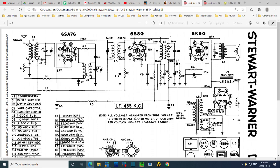So, and this is about the local oscillator. So this is having some bearing on the operation of the local oscillator. Unless the fact is, how big is C7? C7 is a big one, 0.1. Unless C7 is so strong in this situation that the signals going through here really can't see past it. Can't see any of this. That's possible too.